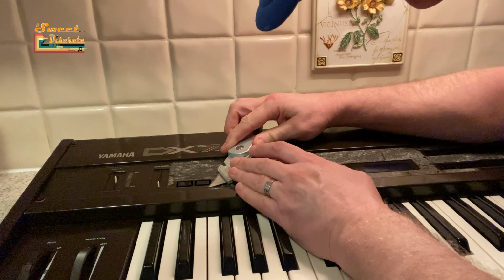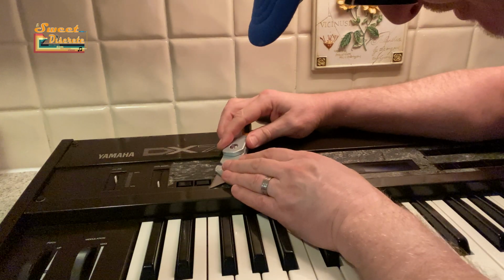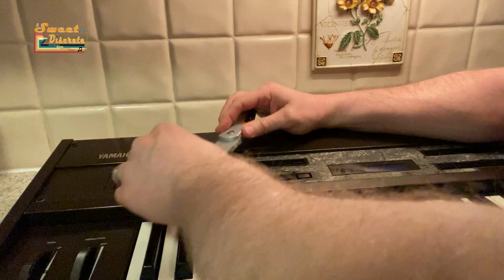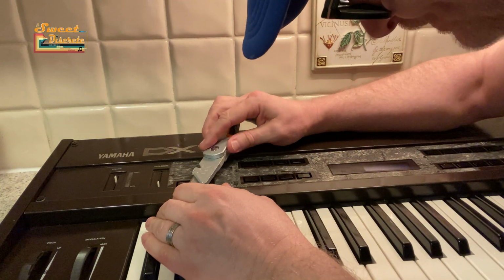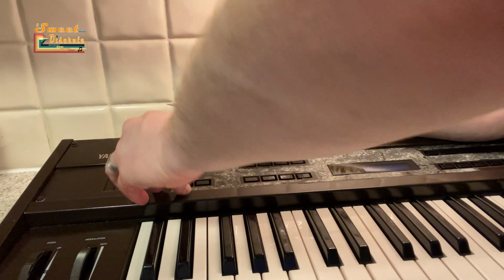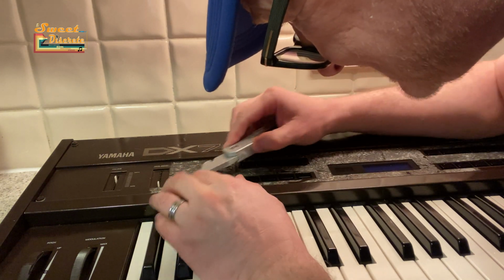Like I say, I'd allow about an hour to strip it. I suppose it depends on where the synth's been living, how hard and fast that's on, how cracked your panel is. But this won't come off in one, it just breaks up. Everything breaks up. And that's the problem with membranes. They're a great idea at the time, but they do not last.